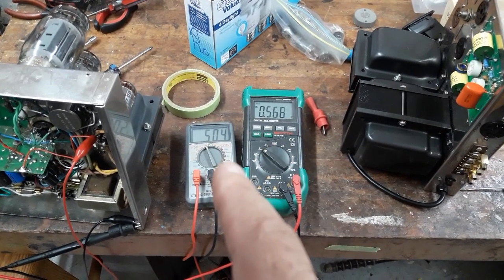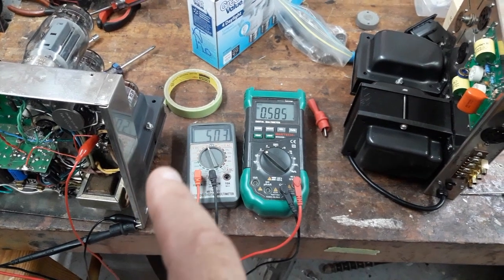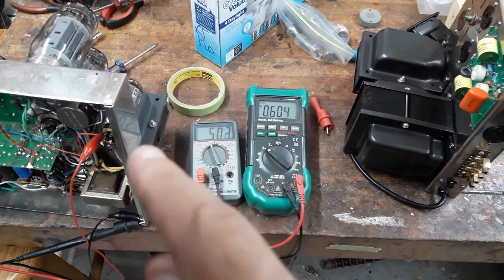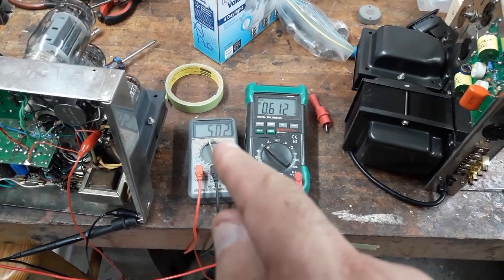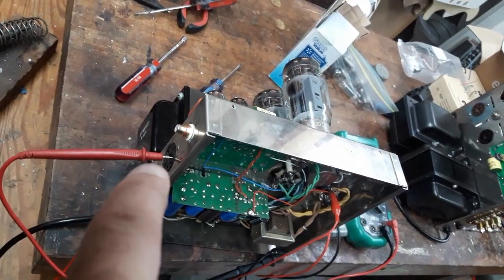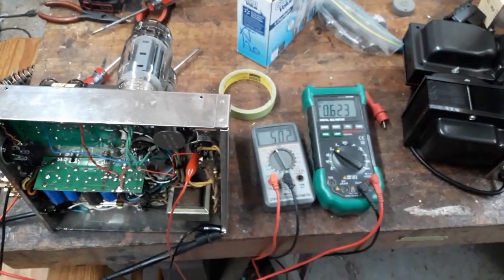And this is settling still pretty high. It has a tube rectifier in it, which to me is the lower voltage of the options available. If I had the solid state rectifier in it now, that should be higher, about 520 or so. So this needs to be cooled down a little bit. This is measuring one of the tube draws through that socket there. I'm going to switch to the other socket and let's see how far off the other tube is.